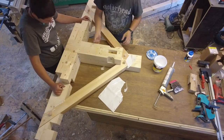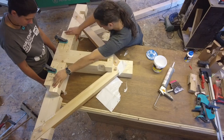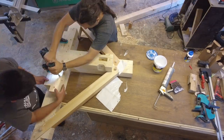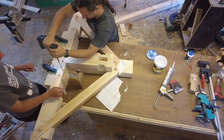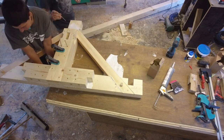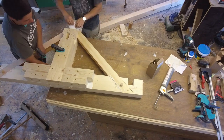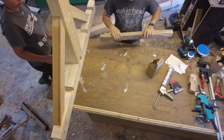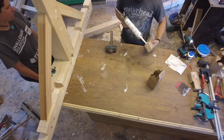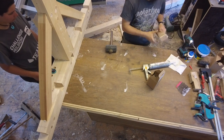To bind the two main parts together, we used white glue and 15 screws. Later, we insert wooden dowels to improve the connection even more. The substructure of the loading bay was made out of hardwood, which we had lying around in the workshop. It's a quite satisfying feeling when such connections fit together that nicely.